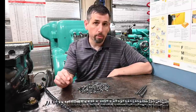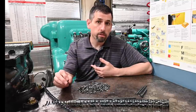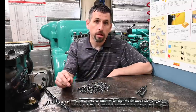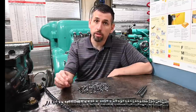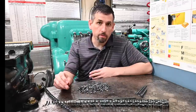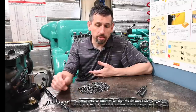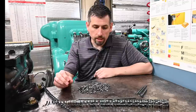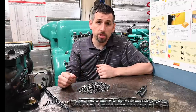I use that big tool because you don't see it very much on YouTube. When people are showing their home shop machines, they're using your standard CNMG 431 inserts. And I thought, hey, it'd be fun if I showed a 643 insert because no one's using those. So it's not because it was cheap. It's not because it was really necessary to even take these big cuts, because you can do it with a 431 insert, but because it was fun and it was something different and interesting to show.